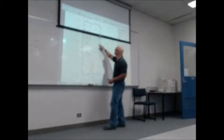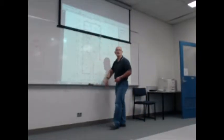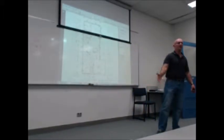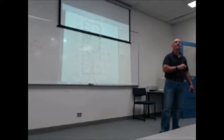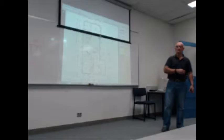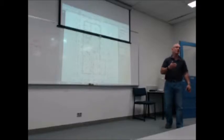This area here? More often than not, the vanity would sit on top of the tile floor, yeah? If that's the way you build, yeah. It's the way I used to build, so I would allow the tiles in there. Yeah. The only thing I'd probably take off is the bath. Cutting around the vanity. Hey? All the cutting around the vanity. Exactly. It costs less to tile right through, even if you're adding those extra tiles in, just for the labour involved in cutting around it.